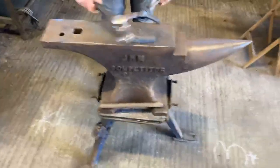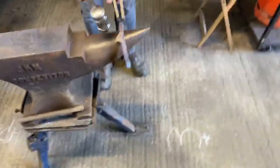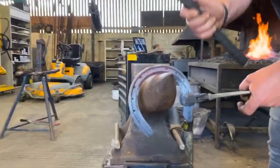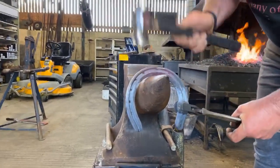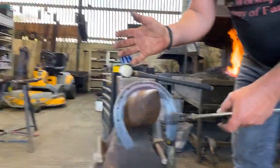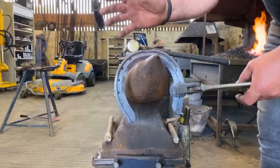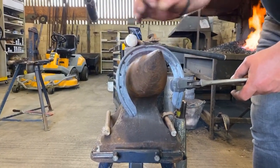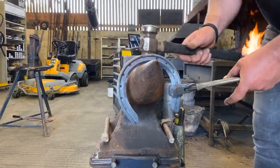Okay, make sure the shoe's level. What a lot of people now do is then set the clip on. What you need to do first is go round straight up and down around the toe, and all this material you displaced there, push it back in so it's flowing. The amount of people just leave it hanging out, you know, like the back end of a sheep who's just given birth to four lambs, okay? But push it all back in and keep it flowing.